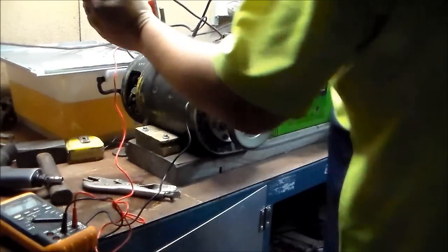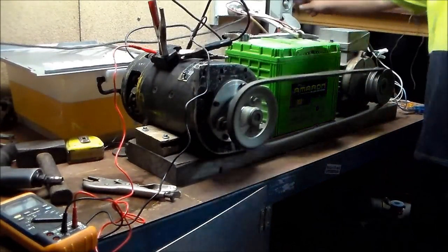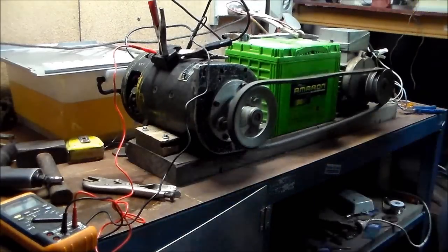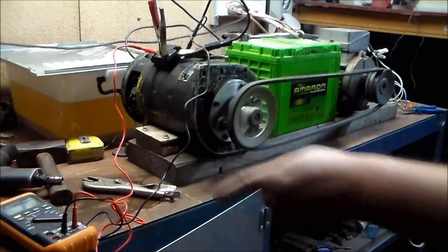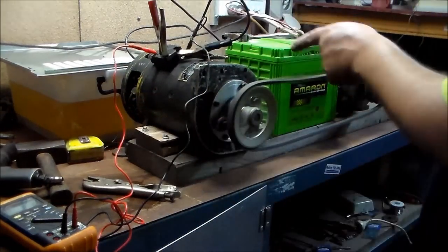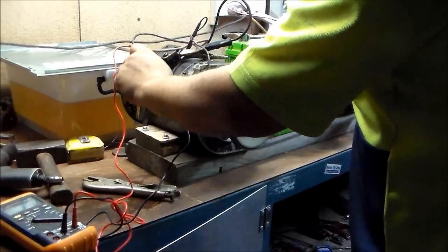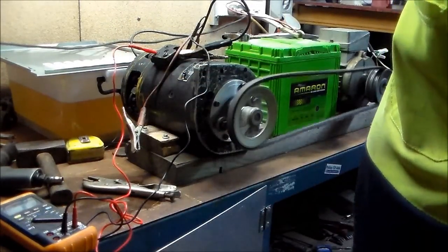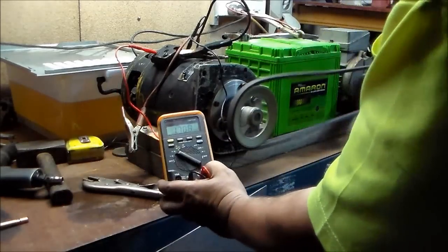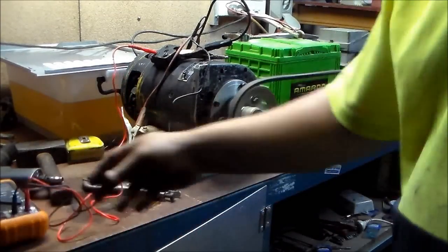It loves 24 volts. I thought the three-phase would slow down, but right now we're getting about 19 volts on the multimeter. So if I remove my field current, it very sharply drops down to about 1.7 volts. I don't know if you can see that too well there.